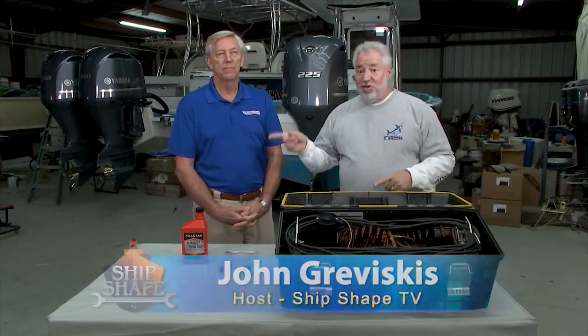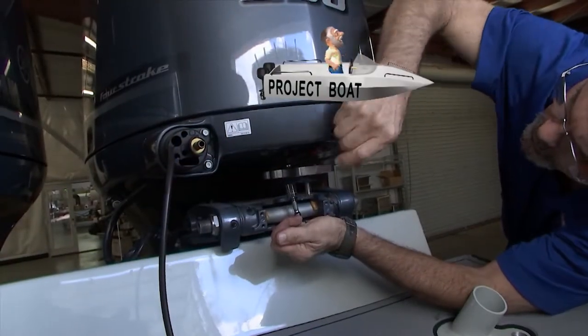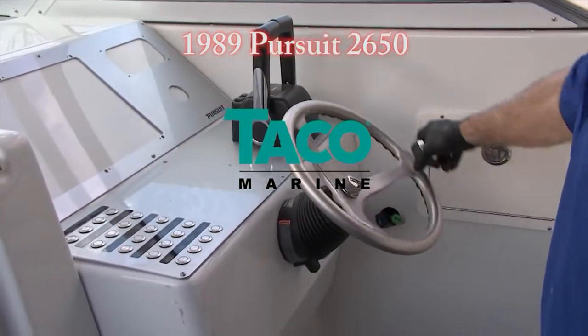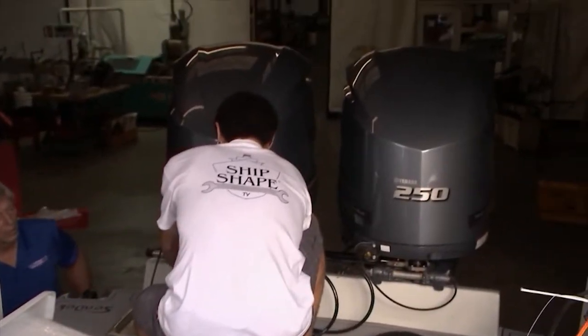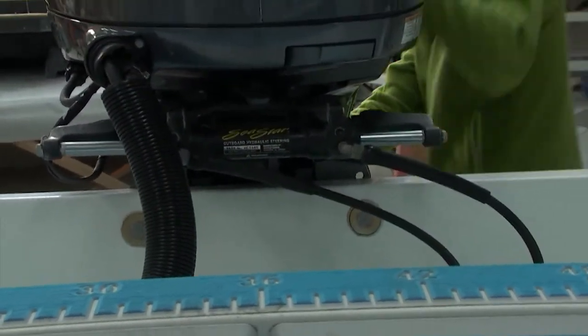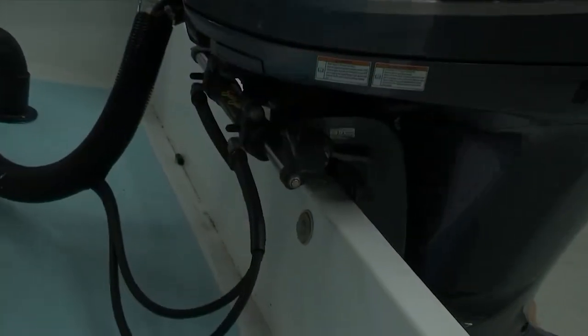I'm John Graviscus. This is Tim Howard from Boat Steering Solutions. You did the hydraulic steering system for the Takamori Project boat over at your shop. Yes, we did. It's got twin Yamahas on that, and when we pushed on those motors, because it was done properly, no air in the system, they were rock solid. Jonathan's moving this engine back and forth — that's a visual sign saying you've got air in your hydraulic steering.